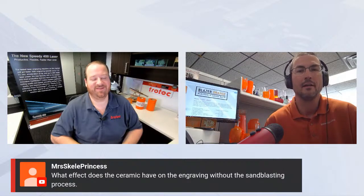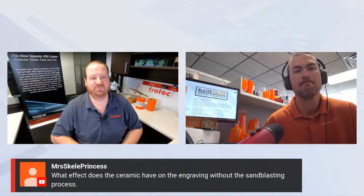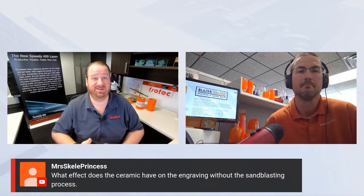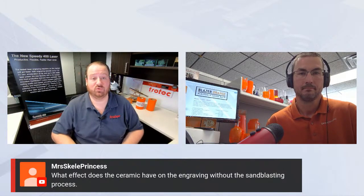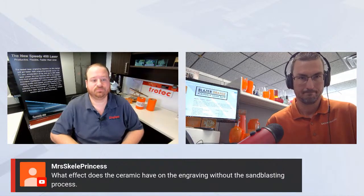Right. The color under the rainbow. Yeah, and what I've found also with ceramic is if you're not sure, try it. Pick up some. Sometimes I've been pleasantly surprised. It worked great. I've even seen depth in some ceramics, but knowing where it came from and how it was processed or made will depend on how it's going to respond. But 9 times out of 10, it's very difficult, if not impossible, to really get any depth or contrast with the laser alone, on ceramic at least.